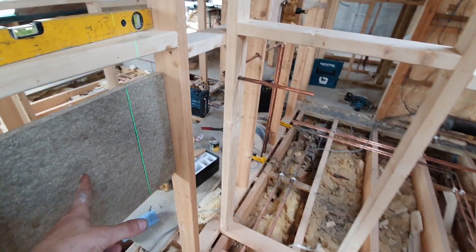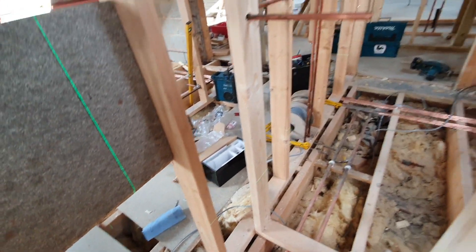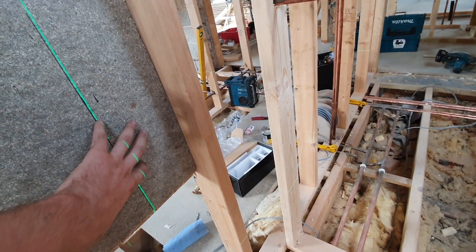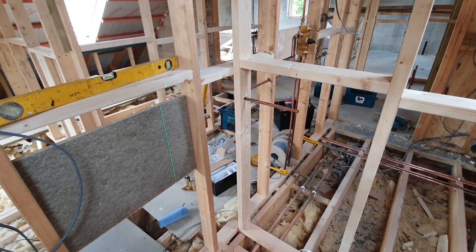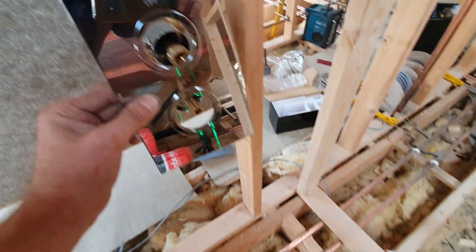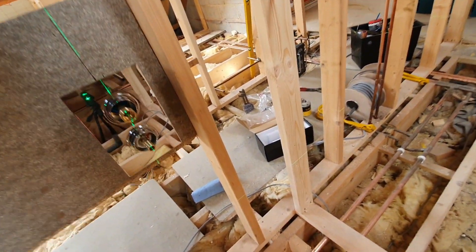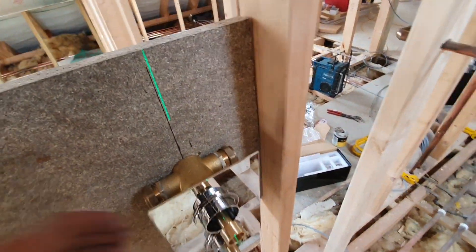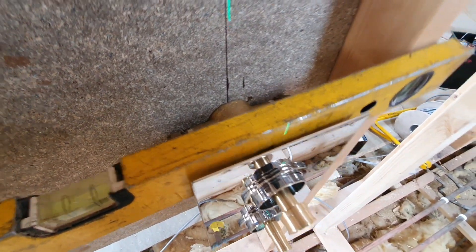I've just got the laser set up. This is the centre of the bath - 700 bath going in, plus the thickness of the plasterboard on this side. This needs to be dead in line with the overflow down here. I've set it up to the right depth, plumbed this board up, and got it screwed in nice and solid so it gives me something to screw my shower valve to. It's just a case of piping these up, fixing that one at the top, dropping this one just below the bath, and then that will connect into the overflow. A top tip - always take your O-rings off while you're setting this plate up, just makes it easier to slide on and off. I always double check with the spirit level to make sure the plate is level, and check your depths - we've got plasterboard and mermaid board to go on here, so we're fine.